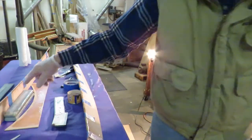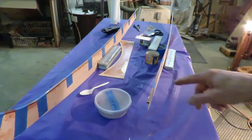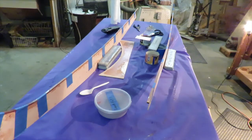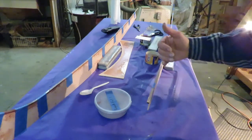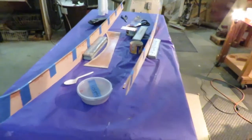We have sapele edge rails on top of each of our splash guards and they look really good. Standing them up like that is best - if you lay them on their side that'll push the rail sideways a little bit. So standing them upright, wedged in place, is the way to go. Those will set up overnight.